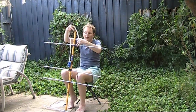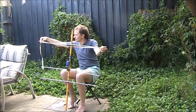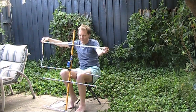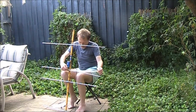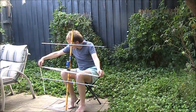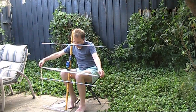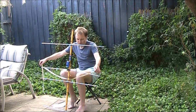As far as the element lengths go, the reflector is 105 centimetres. The driven element is 101 centimetres end to end. This is a Yagi which I think I've optimised for about 144 to 145 megahertz for the SSB portion of the band.